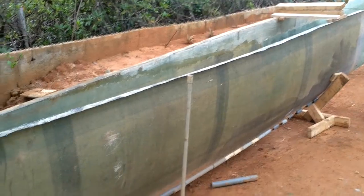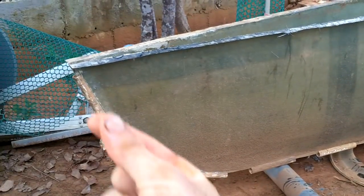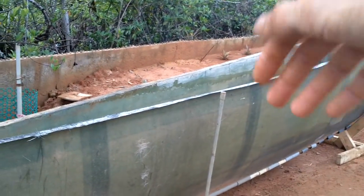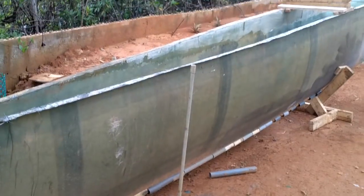Oh, and a few people asked how I got this mold. It's from the shark slicer, and if you go to construction boat like 1 or 2 or 3 or something, you'll see me making this. I'll try to remember to put a link in the description. Basically, it's 2 flat sheets. This was a flat sheet and the other side was a flat sheet, and I connected one end, connected this part all the way here, and then stuffed pieces in that were the cross section I wanted, and then I put some more fiberglass on the outside to make it keep that shape.